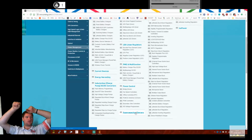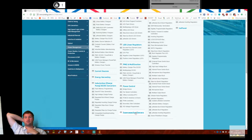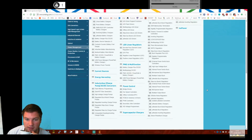The problem with the commercial Supercap chips is that they aren't designed exactly for that. Commercial Supercaps are 2.5 to 2.7 volts. That's no good for our stuff because we want to push them up to getting on for 8 volts for our in-house made ones. So it means we can't use the off-the-shelf stuff. Really irritating, but these companies are market driven and there isn't a market for 8-volt caps at the moment because they're not in production. We've only just discovered them in the last couple of years, so it's going to be a good 5-10 years before they hit the shelves.